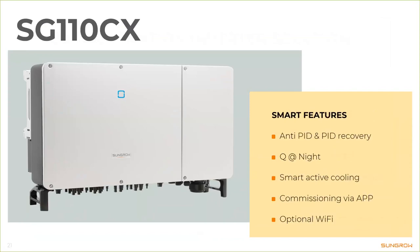We also have plenty of smart features included, like anti-PID and PID recovery. For anti-PID, during daytime you can shift the star voltage so that there's no negative potential between the PV modules and ground, preventing PID from happening altogether. For PID recovery, you apply a counter voltage to the PV generator to regenerate existing PID damage — so you can not only replace an inverter with one of higher efficiency, but also rejuvenate the PV generator.